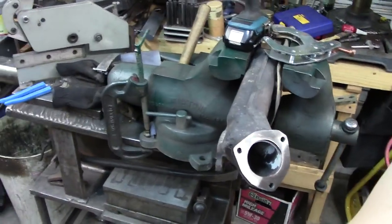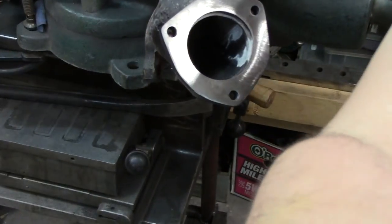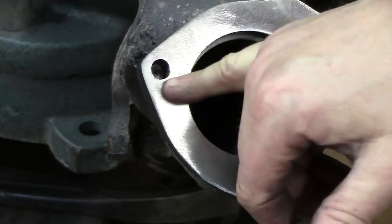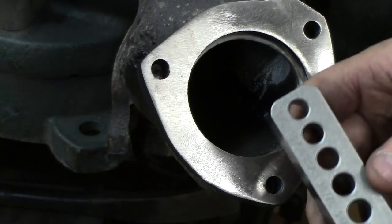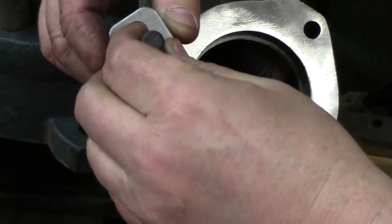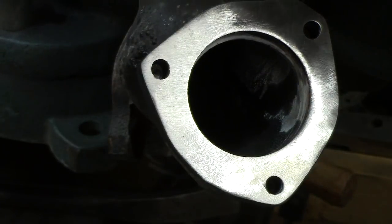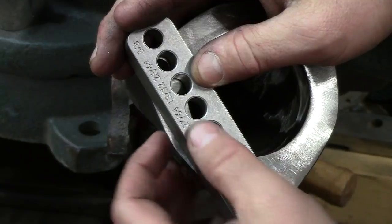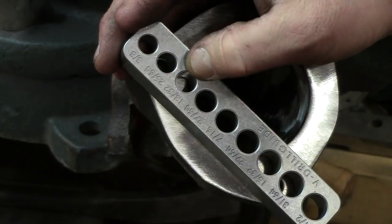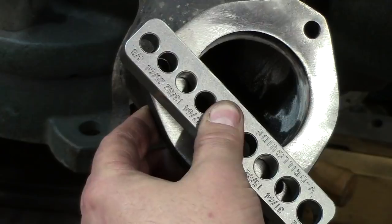Okay, so how do you find your location? I'll show you. You can see that this part of the hole is where the drill bit wandered to — it's not a big deal. What I'll generally do is line where the original hole is up with where I want it to go. Now if you do that and you slide the bit in, it's going to kind of want to fall in between the two. So what I'll do is set the drill bit down, look through here, and line up on where the original hole is. Then come in here and lock this down.